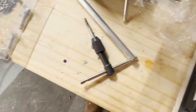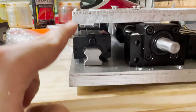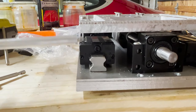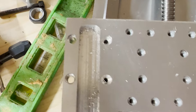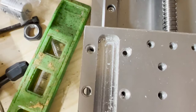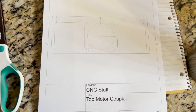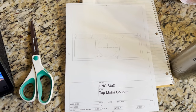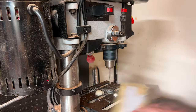For a hobbyist machine I feel like this is really solid. Moving on to tapping — and there it is, a rite of passage for all machinists: I broke a tap off in the plate. There's now a part of my shop that is forever in this particular assembly. I also noticed a little gap between the plate, so I had to widen out the holes and created spacers from aluminum stock.